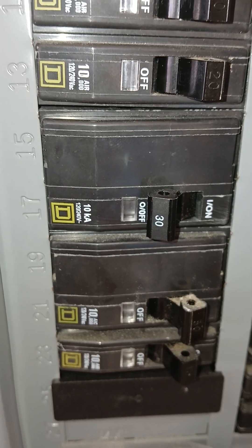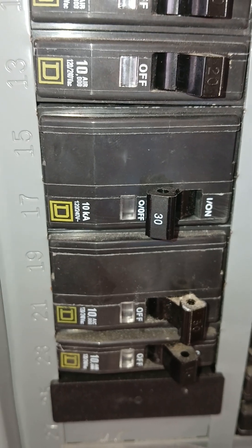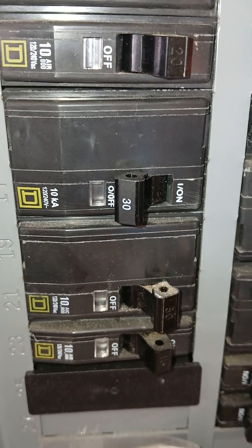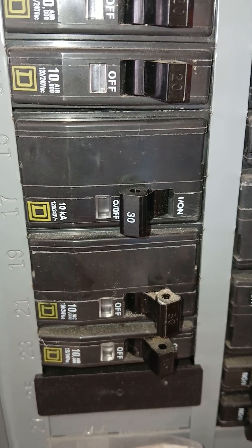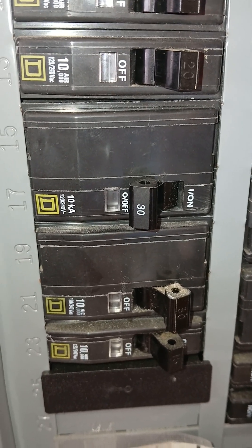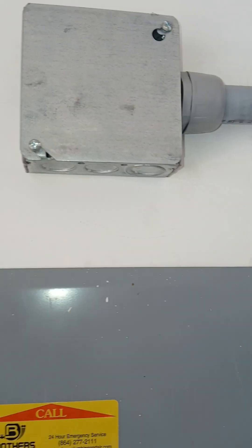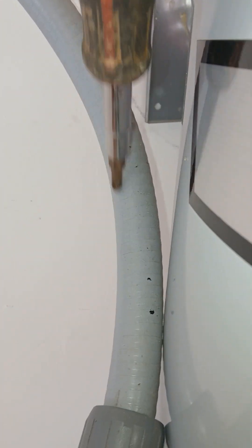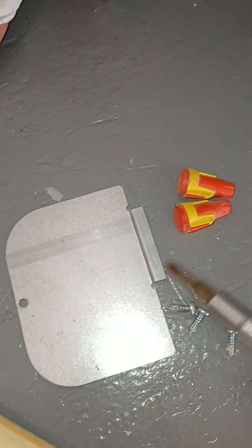A lot of times they're a double pole breaker, so be sure to check your electricity because this is high voltage and high voltage can bite you if you're not careful. A 30 amp breaker feeds up through a junction box — sometimes we call this a whip in heating and air conditioning — then it comes down and they've got a little plate here that feeds this.